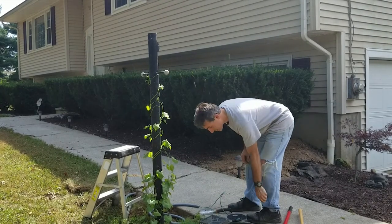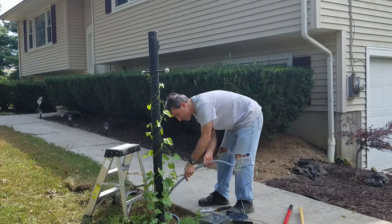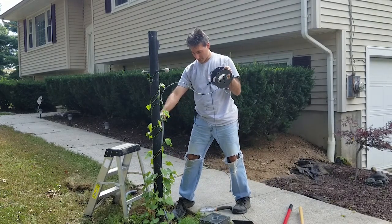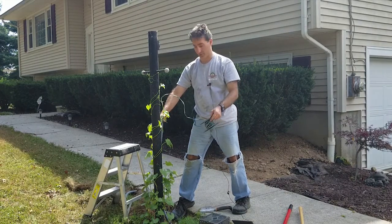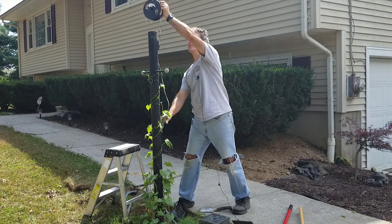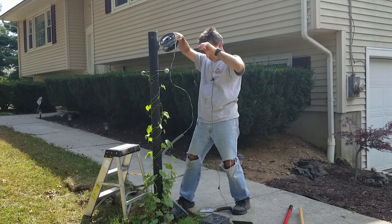With the conduit buried up to here, let's get the final length set. I've got a little channel set here. I'm going to leave the extra conduit and feed it into the lamppost, just in case in the future somebody decides they want the lamppost a few feet over — they'll have plenty of conduit. I'm going to leave this as is and go a little bit extra on the wire as well. I won't be able to move it far, but I can just tuck this down there.